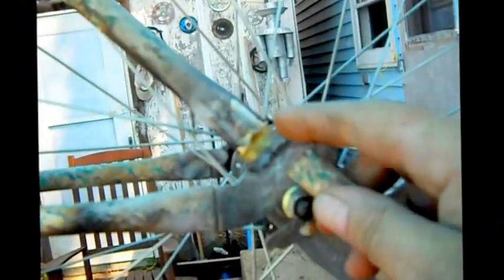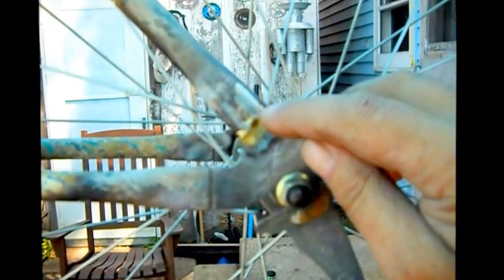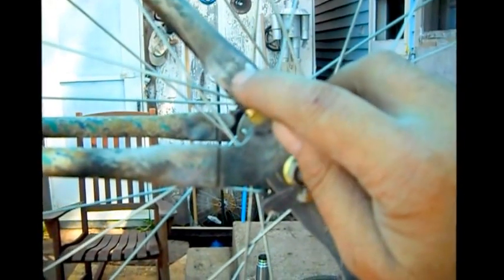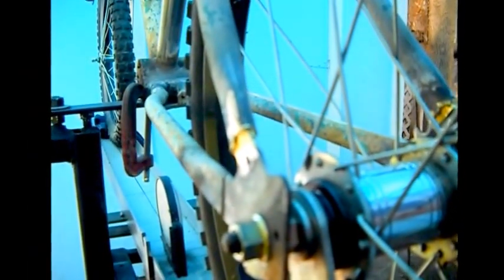What you do is, we cut out — this comes off, this comes off — we cut out about this much. You go up here about an inch and you'll find the shape where it curves in. Find that, grind it, then take your cutter wheel and cut off the piece. Then clean all this up. Leave the metal on the inside. If you look down there, the metal of this pipe is still there, because you'll be squeezing these in a vise. Make sure you keep it centered straight.